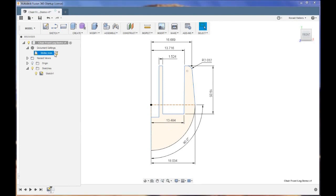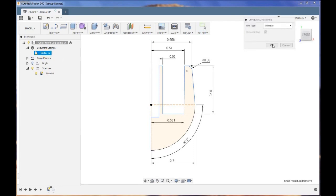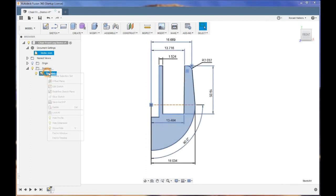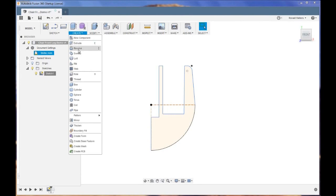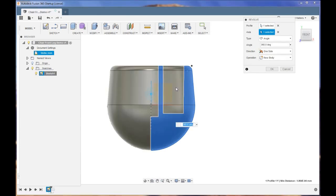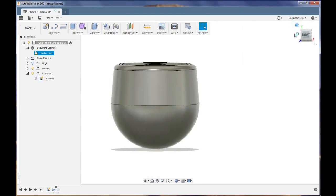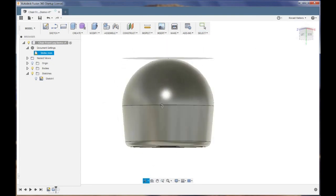This section is tapered. Originally drawn in inches, it's tapered from 0.531 to 0.54. This was converted to metric so when I go to Cura it will print properly. Now I'm going to rotate this 360 degrees to make a solid. This will be printed upside down with the center section on the build plate, giving it proper support for printing.